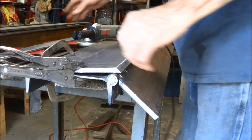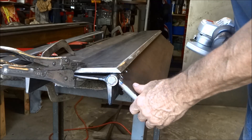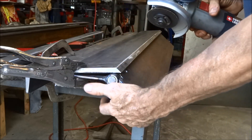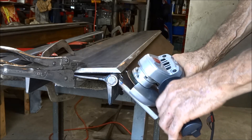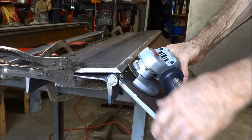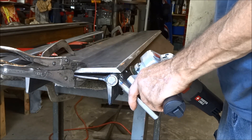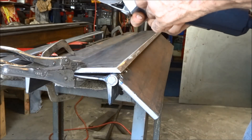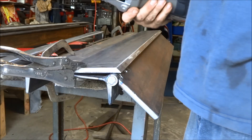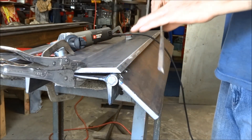Getting ready to start welding up the finger assembly. Before I go any further I wanted to show you how I did this. Brought this out to the edge of the table so it's held up at the right angle, clamped it all down. Then I took a grinder and went across it real slow and easy once I had it clamped in at exactly the right spot, got a good line all the way across it, and just started going back and forth with the grinder setting against this. Got a little bit of swirl mark on it but that's not going to hurt anything. Took about five grinding wheels to cut that off.